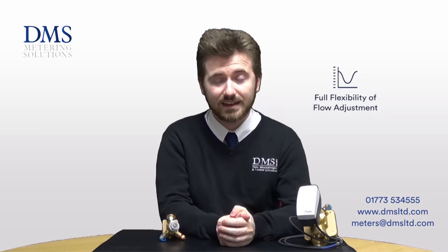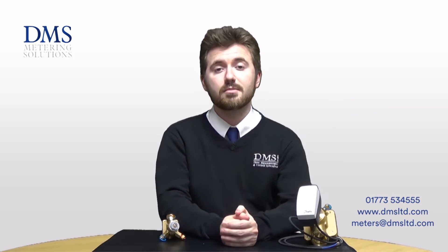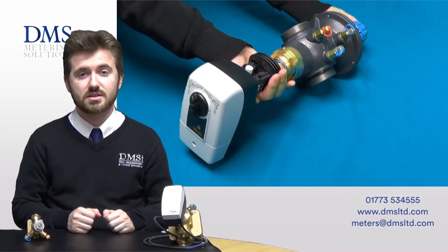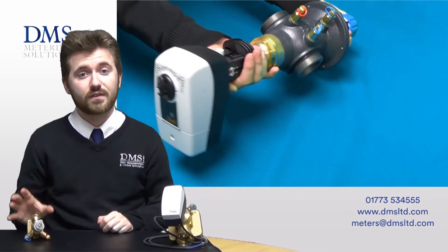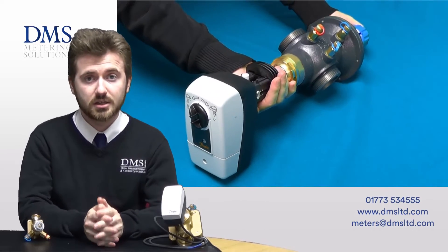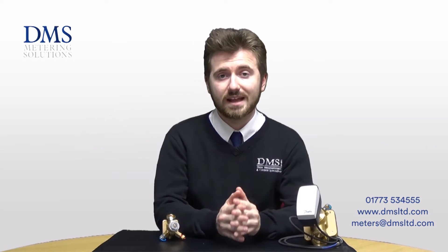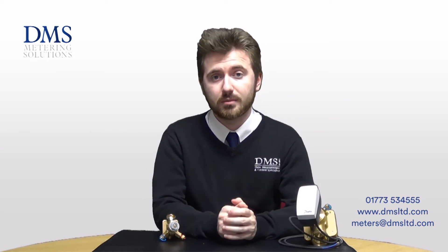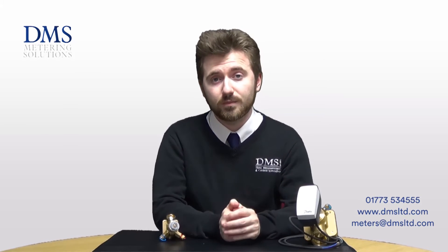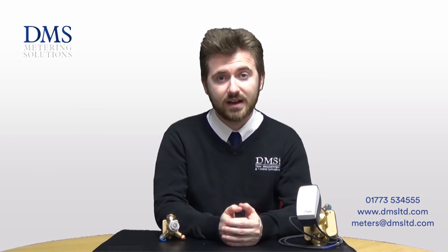Ultimately, installation costs and heating costs will both be reduced as the system works in a more efficient manner. The AVQM valves are available from 10mm up to 250mm in connection sizes. The smaller 10mm up to 50mm valves are all a screwed union connection as standard, while from 65mm up to 250mm the valves are supplied with a flanged PN16 connection. All AVQMs have a preset flow range as a minimum and maximum, so you must always check your flow range — not just the line size — when sizing up your corresponding AVQM valve.